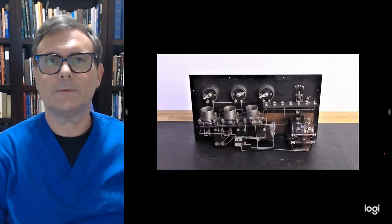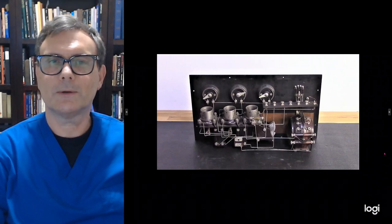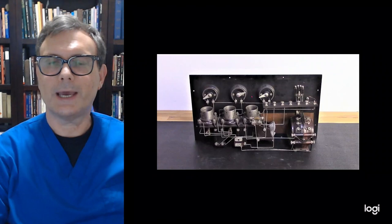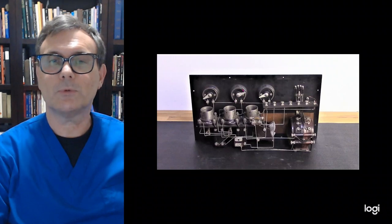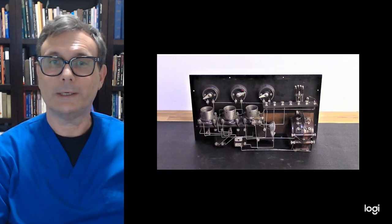There wasn't a lot of ads on this one. I don't know that they sold a lot of the models, but this is a rather interesting variation of the Model 101 if you take a look at it. What we have is three rheostats, one for the receiver itself and then two for the amplifier section. These rheostats use a 5-ohm section and a 20-ohm section, depending on the gauge of nichrome wire used. So there's two gauges used in this particular Model 20 rheostat.